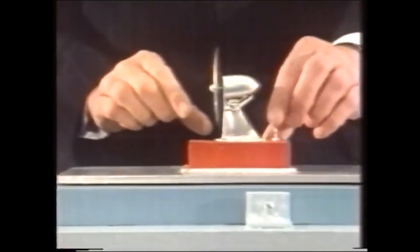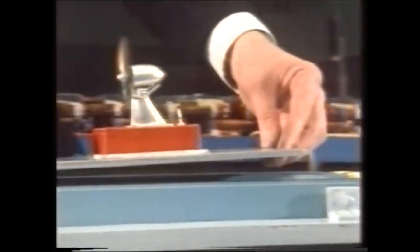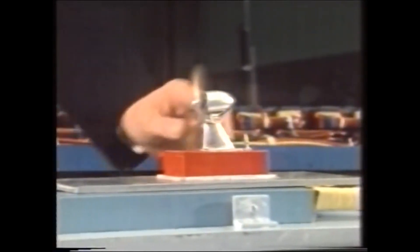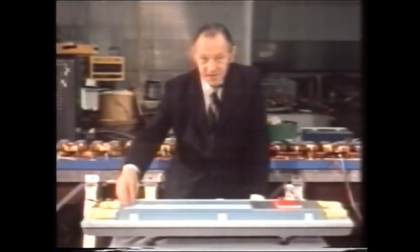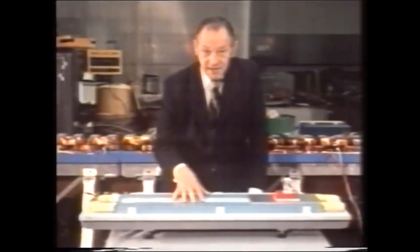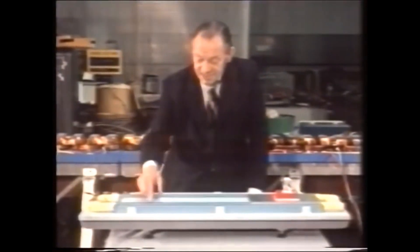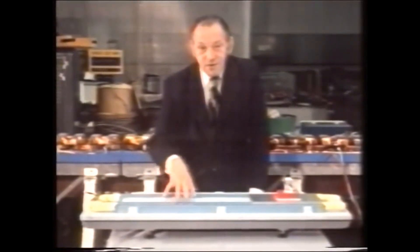Just to demonstrate that, I'm going to put a little air screw on it, and when I switch this on you get your propulsion. There was a time when we thought we should have to put a linear motor up the centre between the coils to get propulsion as well as lift and guidance. But a few months later we discovered that all that was necessary was to break up these two coils into a set of smaller coils, and we could get the lift, propulsion, and guidance from one and the same set of coils.